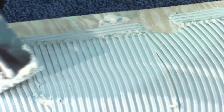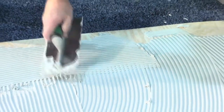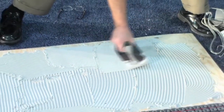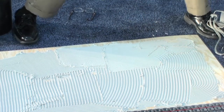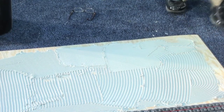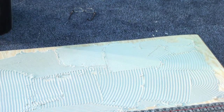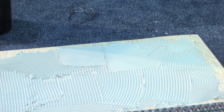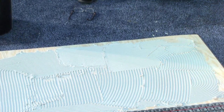So you give us the layout with all your wall-to-wall dimensions, the placement of the toilet and the vanity. We make that mat in only 3 days. This isn't a 3-week process or anything like that. We kick back a custom mat in 3 days that looks just like this. It comes out of the box. Thin set your subfloor; it's a latex modified thin set.